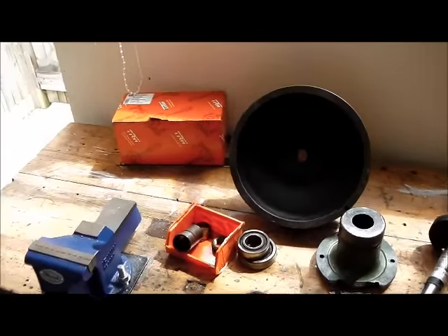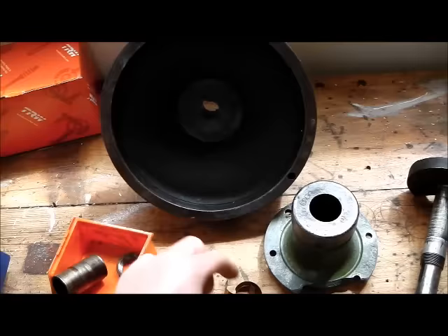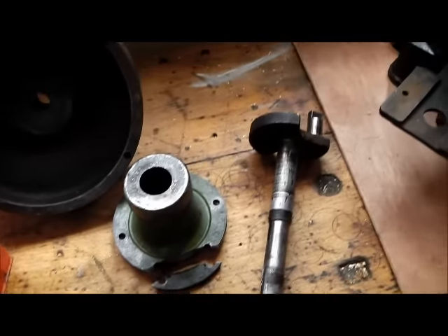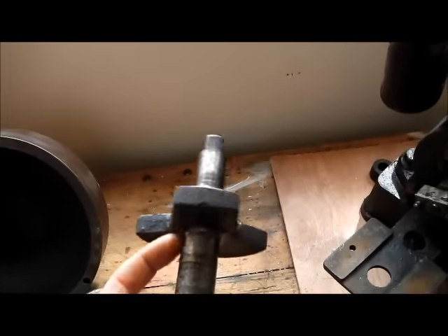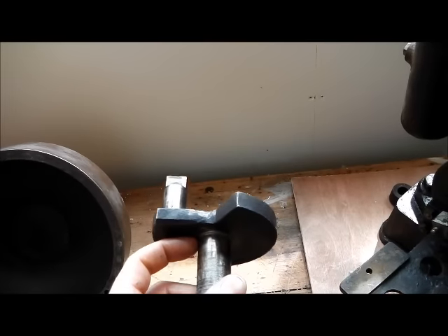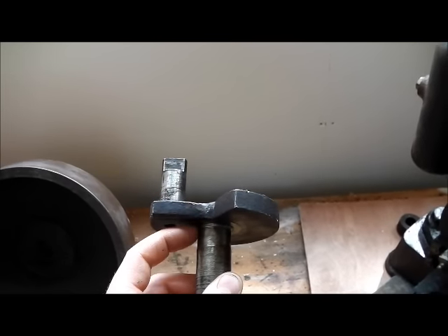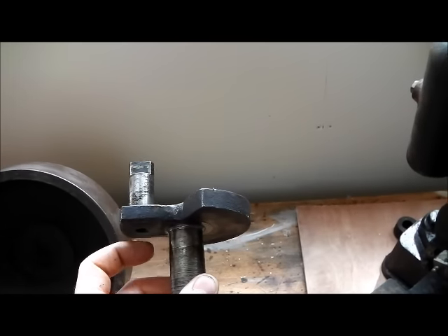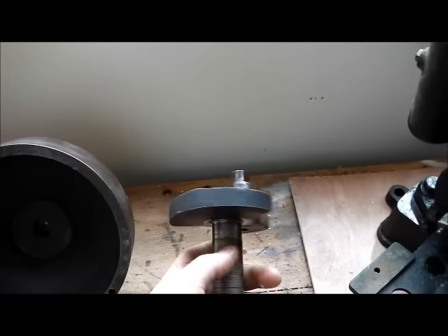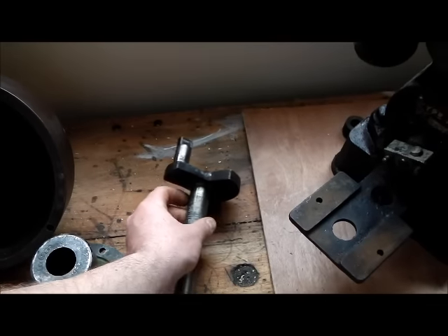So I think we'll have a go at that. The other issue is with the front crank bearing, which is actually held on the crank with tin shims inside, packing it out — probably an acceptable method of repair back in the day but not really these days. The crank is very wasted; I suspect it's had a spun bearing at some time. So I think what we'll do is reduce the outside diameter of that area, then make a couple of shells — turn a bush to put that back to size, split it, and epoxy each side. It would be a very thin shell so as not to reduce the strength too much, and then the bearing can be pressed over it.